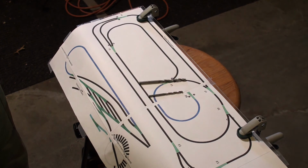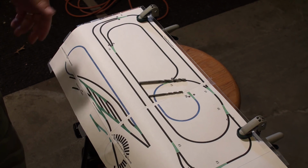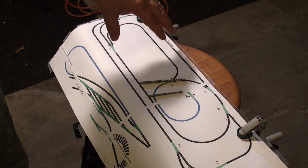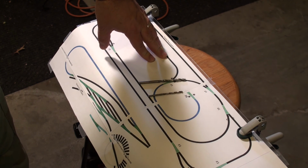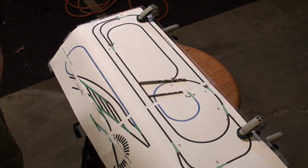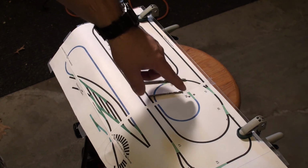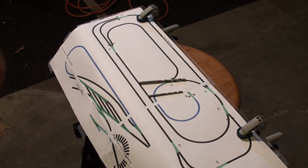Now you could do all this before you do all the cutting and everything else, but I kind of got a little ahead of myself. I still need to drill all my holes. I put this onto a piece of 2x4 wood, so I can drill through the plexiglass and into the wood and not break the plexiglass. So keep it as stiff as you can get it, and secure so it doesn't move around and chip. Otherwise I'm starting all over from scratch.